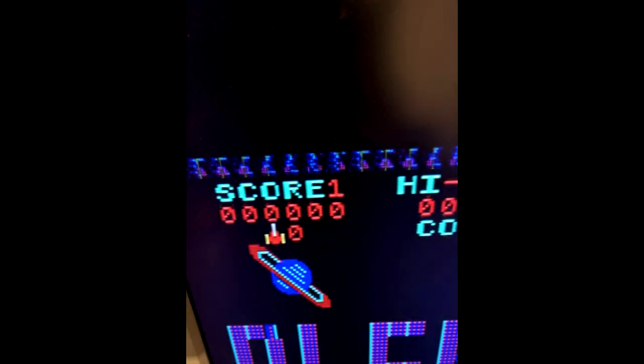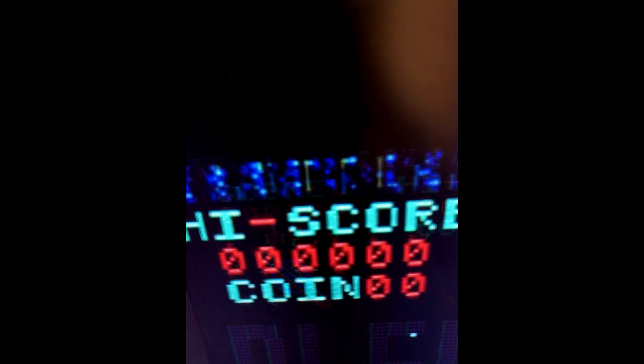It's issues on game boards like this where you have to really analyse logic gates and signals and know how the logic chips work. We're presented here with what basically is a fully working game. This fault doesn't affect the gameplay or sounds or anything apart from creating this interference at the top of the screen. At this point there's obviously some kind of blanking signal missing from somewhere on the board.